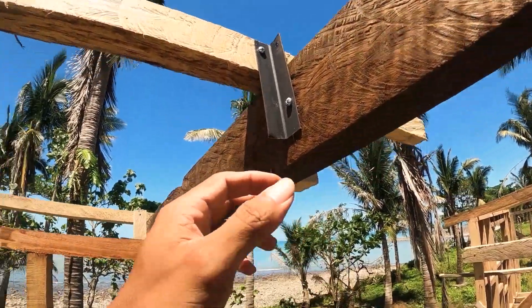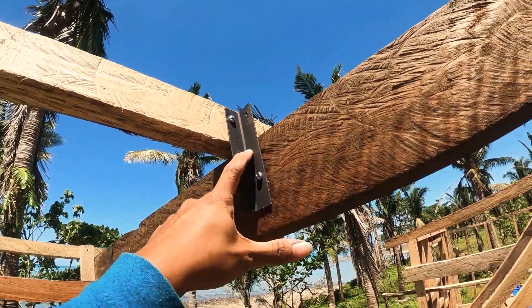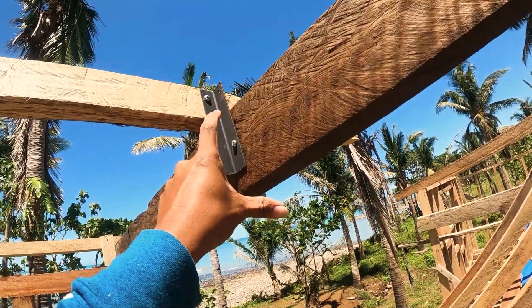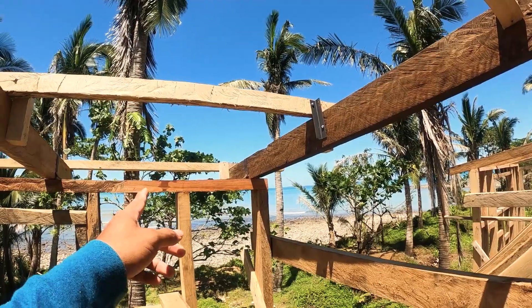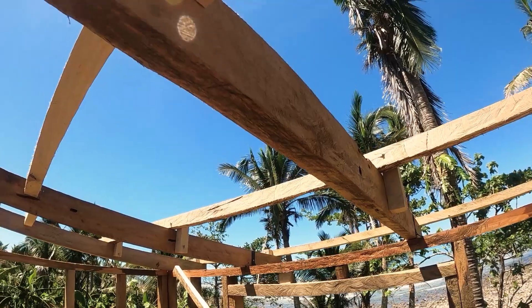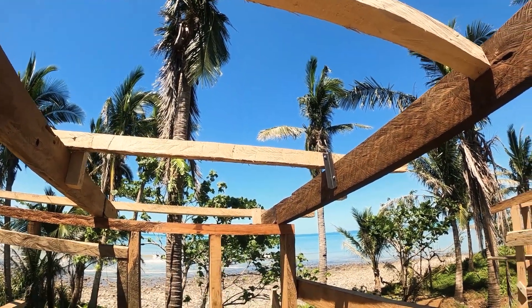So this is the idea: I have a 2x2 on the other side, and I also have angle bar support here. These angle bars are extras from what I bought before, so instead of wasting them, I'll just use them here. The idea is to put these around the sides — I'll put them on the sides; the middle maybe not as important, but the sides are crucial because they take the wind first when there's a typhoon or strong wind here in Pambuhan.